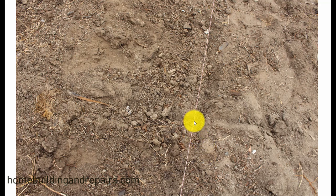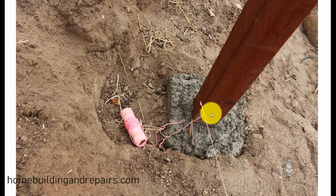Don't forget: if your fence post lumber is eight-foot lengths, that's as long as you can get, then the spacing between posts needs to be shorter than eight feet so you can use your boards. If the spacing is longer, it's not going to work and you'll need to put another post in. I had about 14 feet between posts, so I put a screw in each board and ran a string between them, tightening it up.